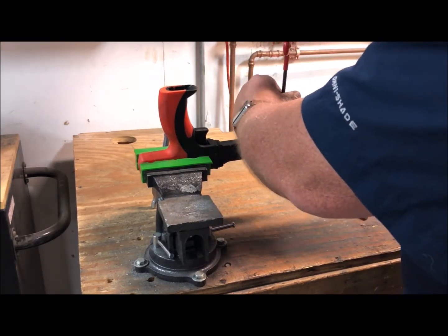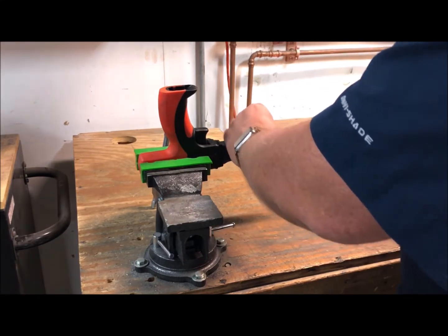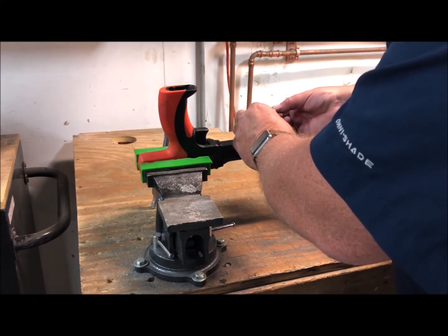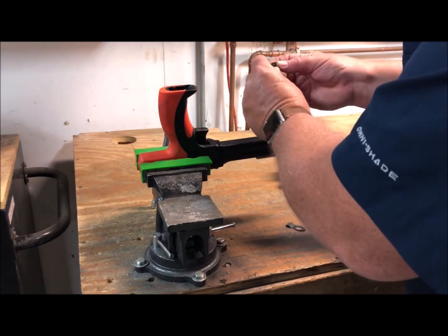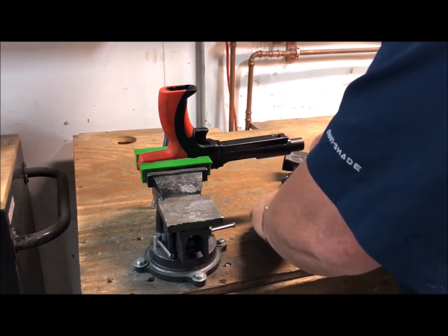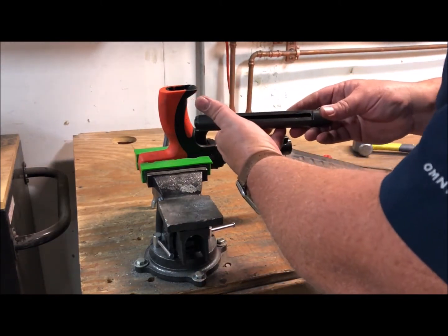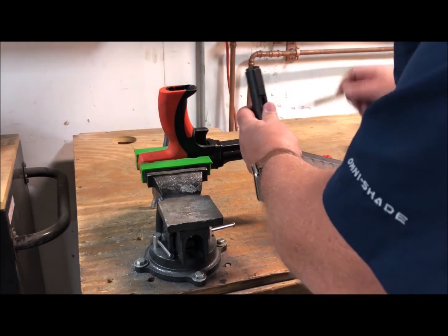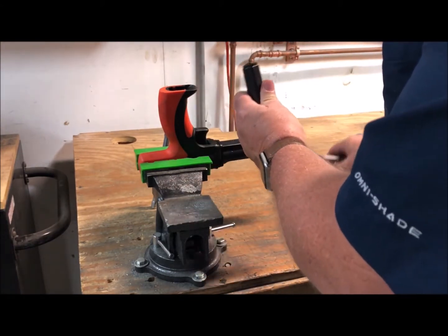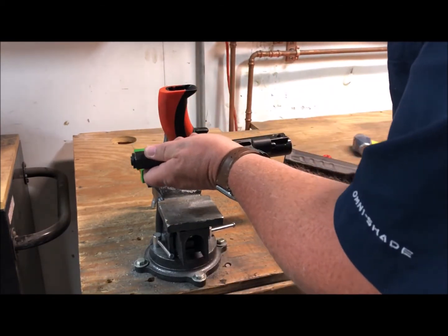The return dog — sometimes it's called a pawl — spin that until it's loose. It's a newer tool so it's pretty easy. As I pull that out you can see the clip comes off. There's a spring; sometimes it'll stay in, sometimes it won't. Keep that all together for reassembly. Now we can pull out our entire barrel assembly. We'll use the punch to push the piston down so we can get a grab on it with the pliers — they will be a little tight.